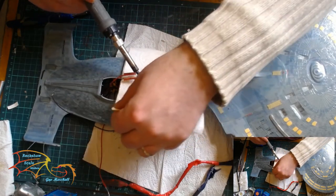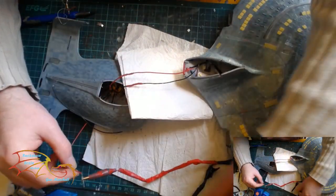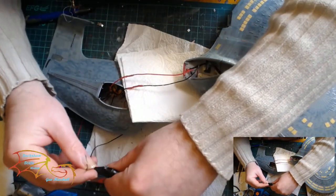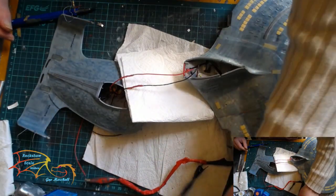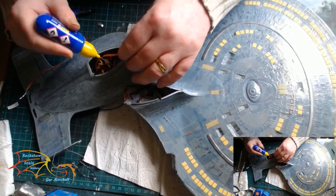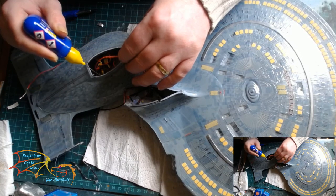I'm shrinking the sheaths down to isolate the bare wire. Because I've made a new solid connection it's time to light test once more. As I've said before, I always light test each time I do something new to the wires, just to make sure everything works — and if it doesn't I can backtrack to the point where it did.